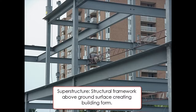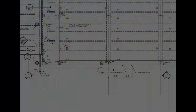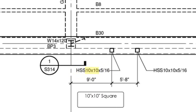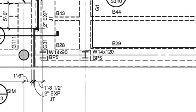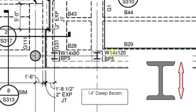This process begins with installation of the columns. Columns can be fabricated from two different steel shapes: tube steel and I-beams. Tube steel columns are identified by the following marking, representing shape, physical size, and wall thickness of the material being used. Like hollow structural columns, I-beams start their labeling with a letter which identifies the beam's shape. The first number indicates its depth in inches.